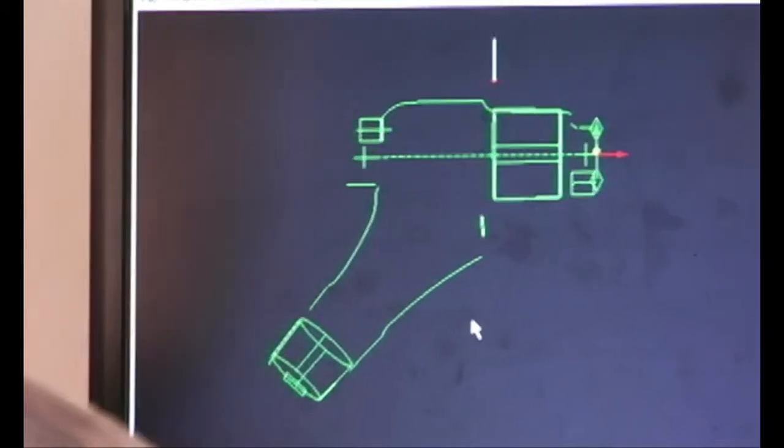And from this, I'm assuming it's going to be able to measure the roundness of the cone. Is that part of what it's looking for? Actually, we call it conicity. Conicity. There you go. So one of the things that the SmartScope Quest platform allows us to do is use multiple different sensors to acquire the data, whatever sensor is appropriate, and then do the analysis. But when we're doing the analysis, we don't need to necessarily be concerned about what sensor the data came from, because no matter where we collected the data, all this data is maintained relative to the same reference frame, and therefore we can analyze away with confidence.